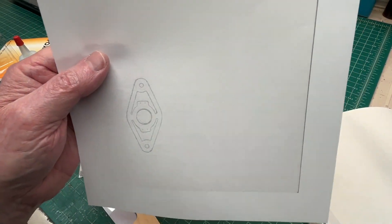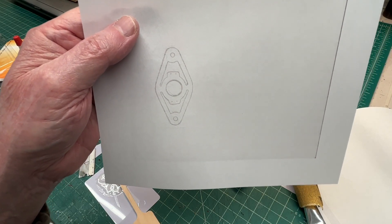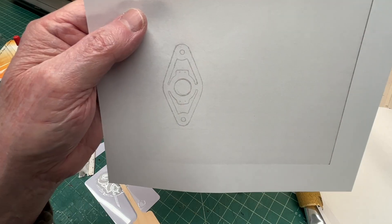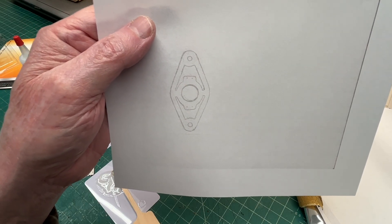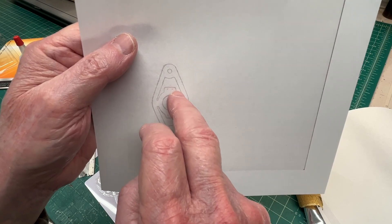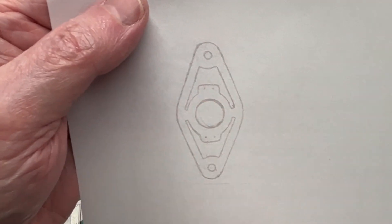If you're wondering where the spider design came from, it was from an earlier spider for a larger speaker — I think it was a five or six inch. I traced it out, scanned it, and then for this particular speaker basket, I just decreased the size by 25% and cut it out. Instead of cutting right in this area, I just went straight across, due to the voice coil itself being just a little larger diameter.